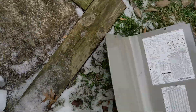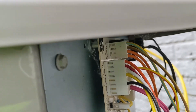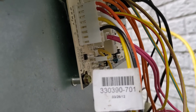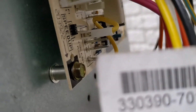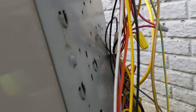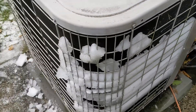What I found was: I went ahead and tested against T1 to common and I had zero — no volts. So this thing is not tracking time. The defrost thermostat is closed, but if we're not tracking time, it's not going to tell it to go into defrost. When I first got here it was on 90 — I just moved it to 30 minutes. But we're not tracking any time. Everything else is checking out.